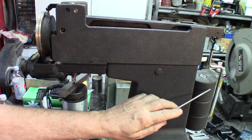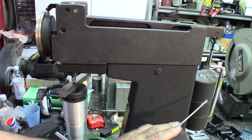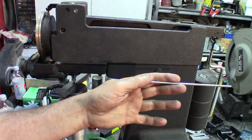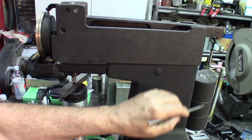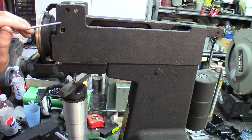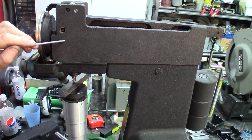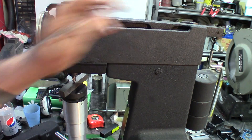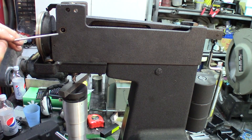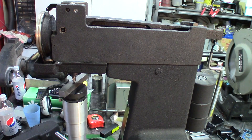The weight system uses the equivalent of 150 kilograms or 330 pounds, but there isn't actually 330 pounds of weight sitting here. There's a 25-to-1 mechanical advantage: the pivot point amplifies the actual weights by 25 times, delivering the full 150 kilos directly to the diamond point. That's how they achieve the required load without a tremendous physical weight on the machine.